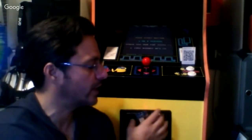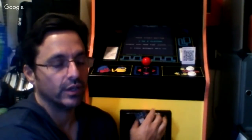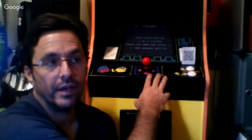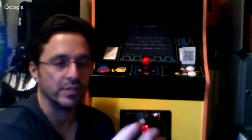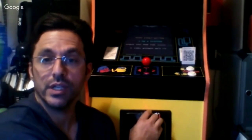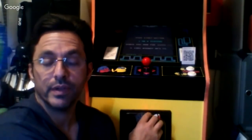So currently, and this is sort of proof of concept, I haven't gone through many iterations. I could see certain things changing. Right now, what this is scanning for is a unique code to the machine and also a price. And what that means is that has to be programmed onto the microcontroller. But now that you say it, it probably makes more sense for this to simply know the unique code of the machine, and then I could change the price remotely. So meaning maybe that should be state information that's stored on the server, and the only thing the machine knows to ask for is about itself.